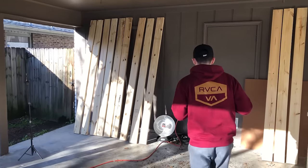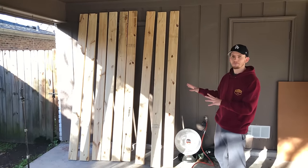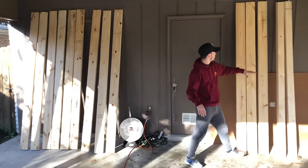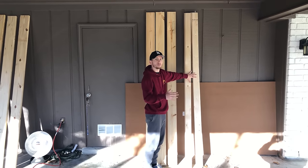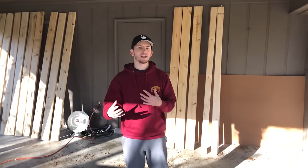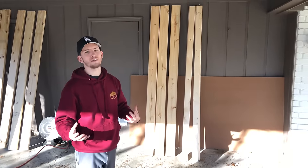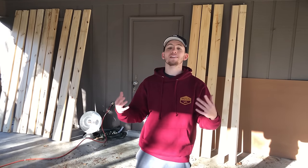We've got some super cheap framing lumber — I know you guys might be skeptical, but just trust us. We have 12 two-by-sixes that are eight feet long. Over here we've got eight slats for the bed to sit on, one-by-fours, eight feet long. And then back here we've got two four-by-eight sheets of Masonite. All of this material was about $95 for us including sales tax — that's not including the tools, but if you're picking up the lumber, that's what it's going to be.